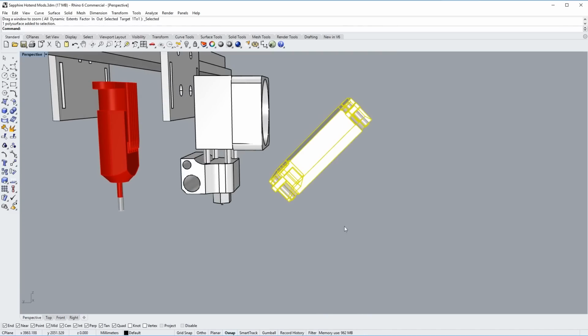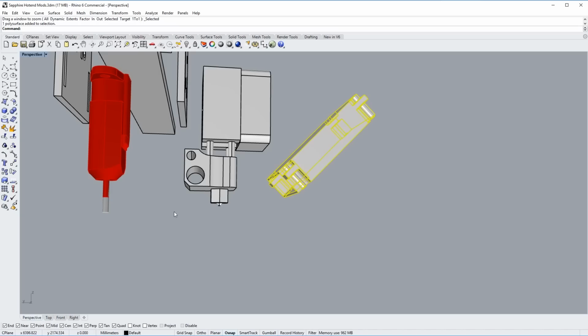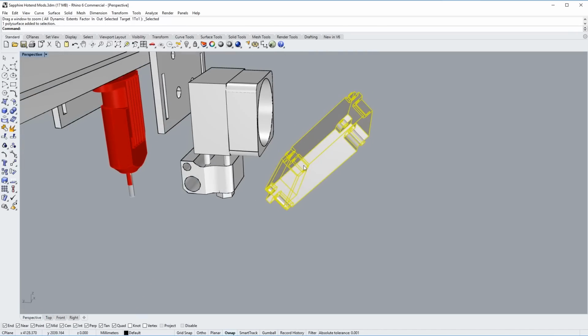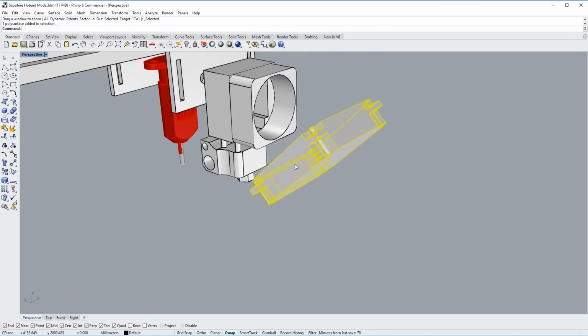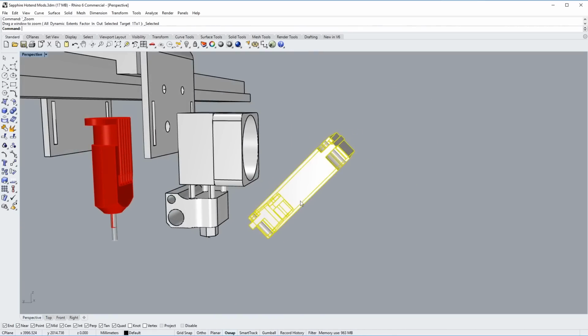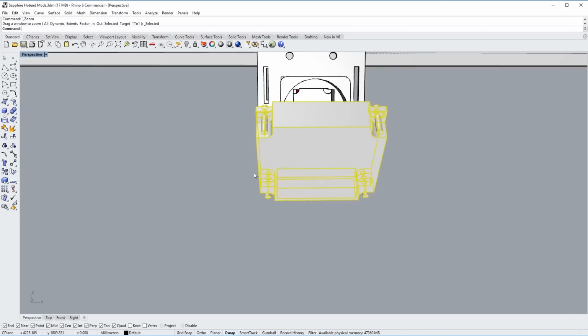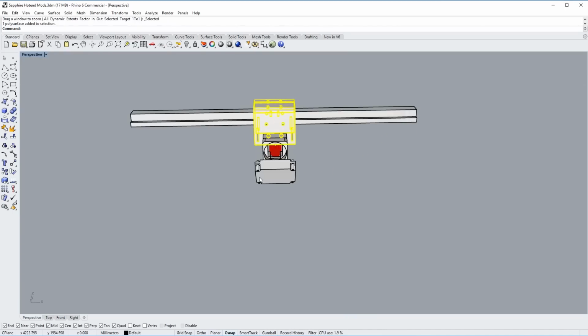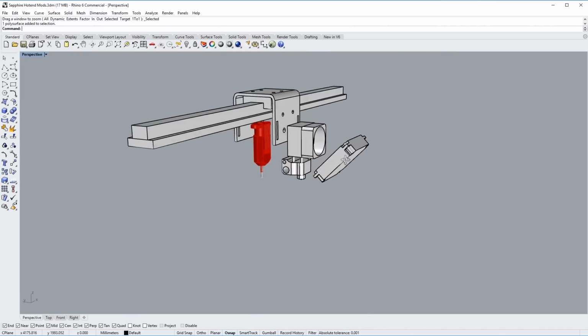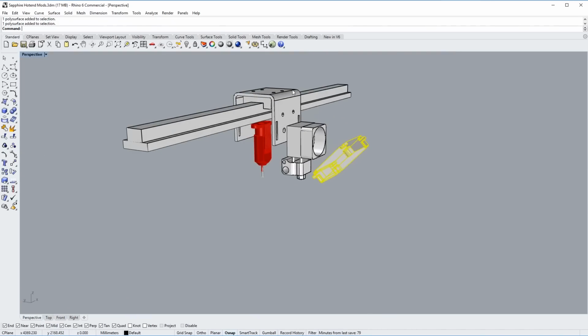Also, putting it at an angle means that you need to turn the air less. It's almost blowing in the direction that it needs to end up anyway. So less ducting and less turning of the air means better airflow. So this is, from an engineering standpoint, the best location for that fan. And it's not wider than the bracket here, so we're not going to have a problem with collisions to the front. I've checked for that, and so I really do think this is the best location.